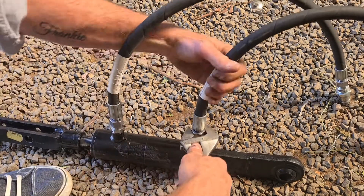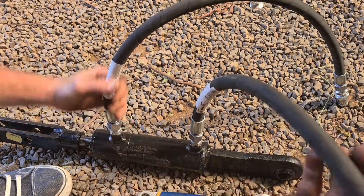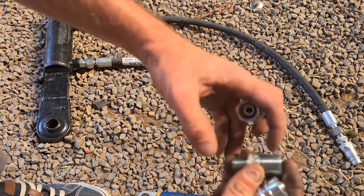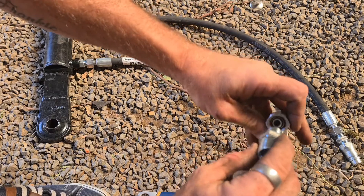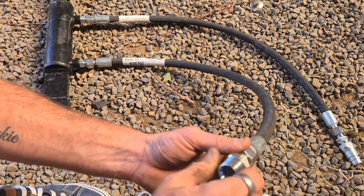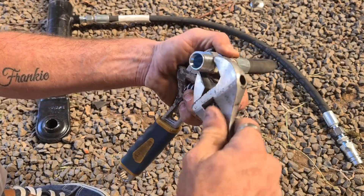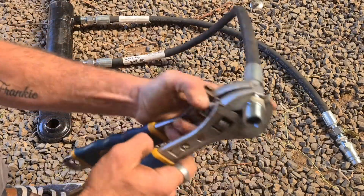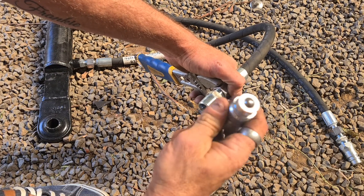At the top end, because I'm plugging these straight into our hydraulic port, we've got another reducer - this is a different size than the one at the bottom. We'll screw that into this end with another adapter to change the thread size. Tighten those up nice and tight, and then we'll go to the hydraulic connector piece that plugs straight into the hydraulic port at the back of the tractor.